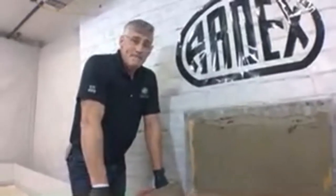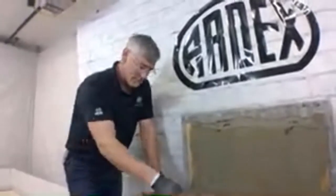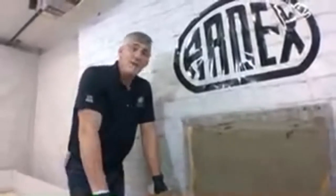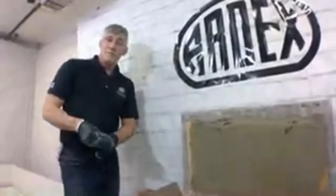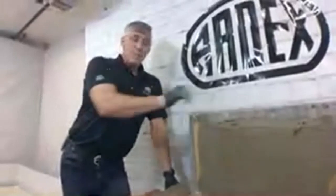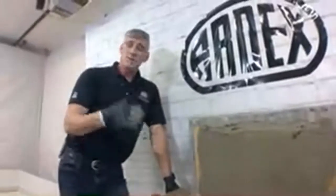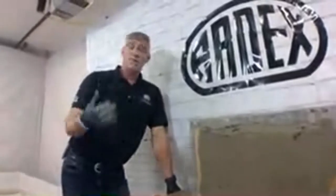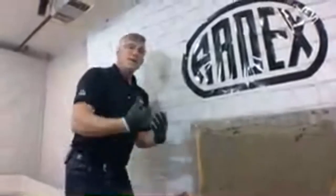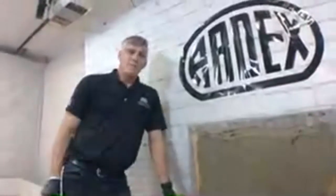Is there an approved method to extend the working time of AM100? Well, it would be the same recommendation that we have anytime that you're working in a hot environment. Always, if you can, keep your package, your bag material cool and out of direct sunlight. Use as cold water as possible. Sometimes we get into this when we're doing large self-leveling installations. We'll actually float blocks of ice in our mix water to cool down the mix water, and that's going to extend your working time as well.